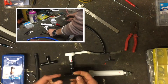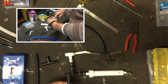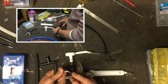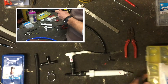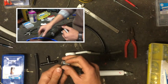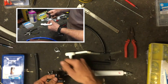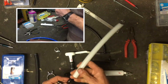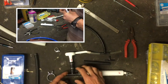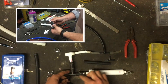For joining them I've literally used some rubber hose — this is out of an old washing machine — and a couple of ear-type clips. You can just get away with using jubilee clips, just the style you screw up and tighten. It really doesn't matter as long as these are sealed when you're making them together. Try to get as little gap as possible so they're actually overlapping or pressed up against each other, because we don't want any flexible tube in the system — we want all this to be as rigid as possible.